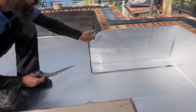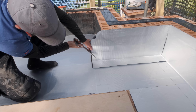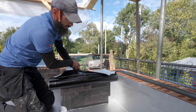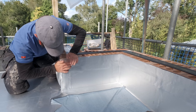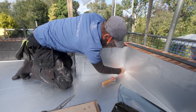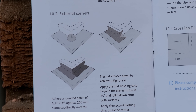Coming around this corner, I've measured 100mm from my crease line, which gives me a perfect 45-degree angle. I'm cutting it down this way, using my scissors. Check where you're going around the back so you don't go too far. Top stuck — same as we've done on everything. Peel it back a little bit, then use the roller on this bit to get it around the corner. This is where that pig's ear was — it's all covered over now. Nothing's going to breach this edge. We've got the corner flashing here, and there'll be another flashing coming on to cover the bottom section.